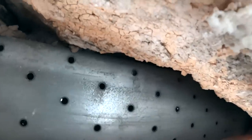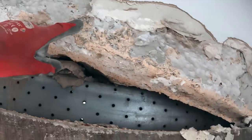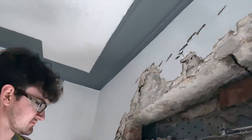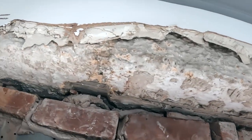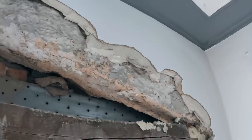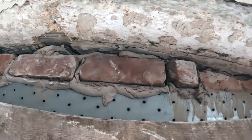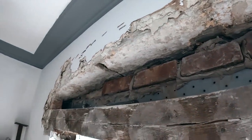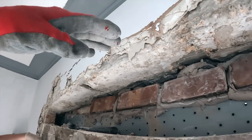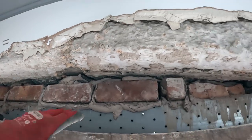I think, looking at it, it's a brick arch, it's either a concrete arch or a brick arch that's been rough cast. So you cut into it that end as well. We need to get a couple of props under, especially where the crack is. And it's not going to go anywhere, because it's all built up on the side. So we're going to work out how high we're going with it. I'm going to cut out for our pad stones, whip this out, and then properly. What we normally do is put the steel in and prop it up, but this is going to be the opposite. We're going to get the pad stones in, sit the steel straight on the pad stones, and then build up on top of that, which is the opposite way around to what we normally do, but it's actually easier.